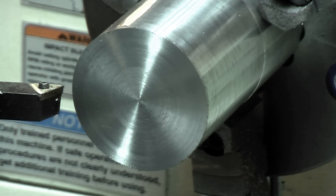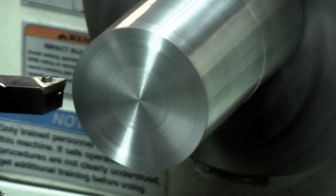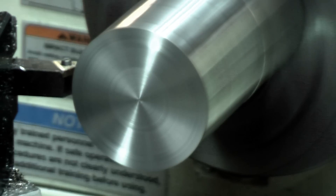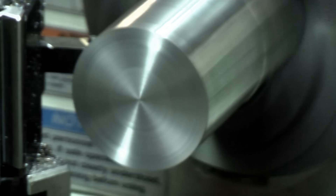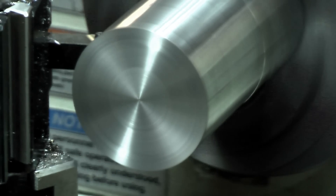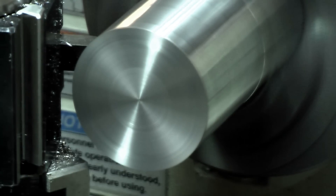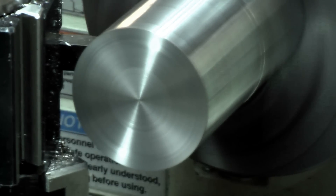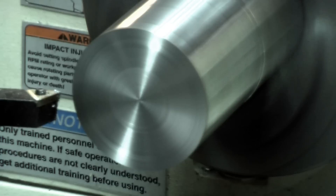Let's see where an R8 can run in. About two and a half inches will make a mark. So I need to run my shaft down to three quarters of an inch to that length. There's a lot of material in there.